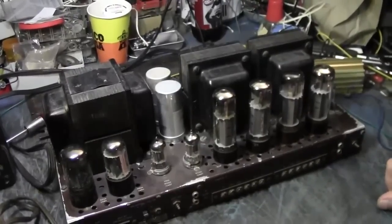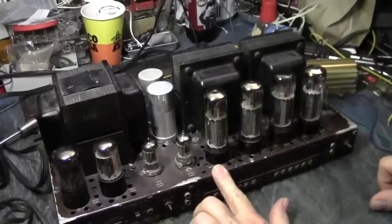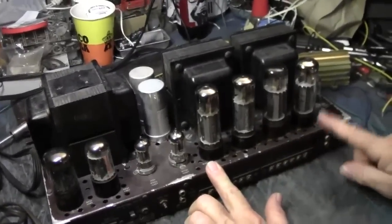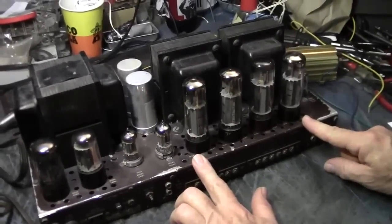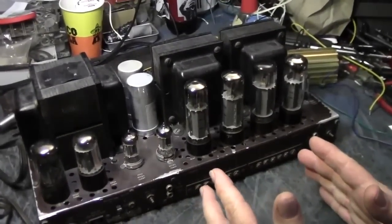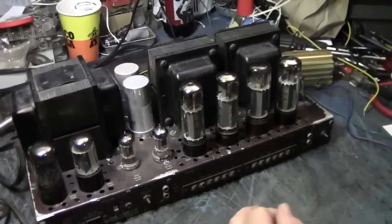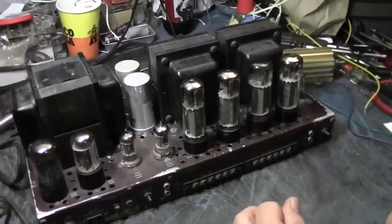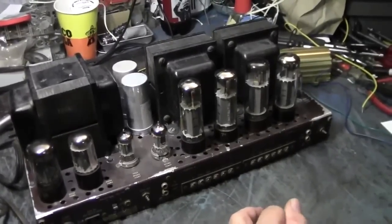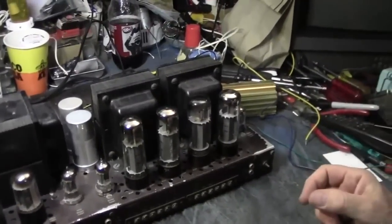I mean, it lit up, but if I'd put a speaker to it, this channel would have been okay, except for that tube that's not lighting up. That's a bad tube socket, probably. This channel would have sounded like crap because without the cathode resistor, which controls the bias and the damping, it's using the capacitor as its current path because the capacitor shorted. Without the resistor to dissipate the voltage, the capacitor's probably looking at 100 volts off that tube, so it's out of its characteristic.